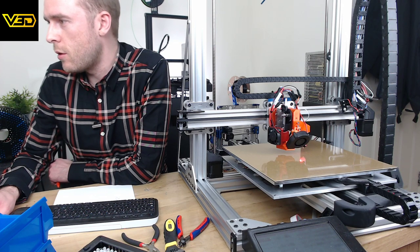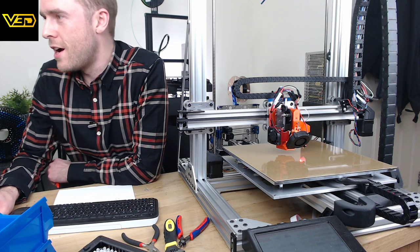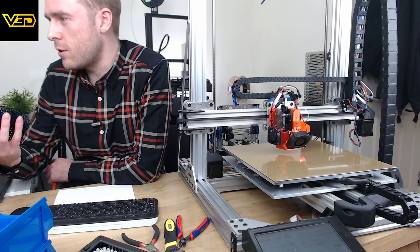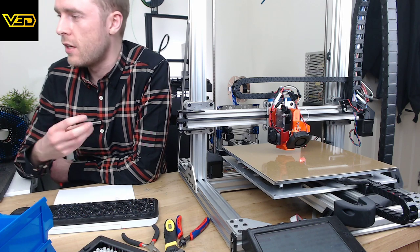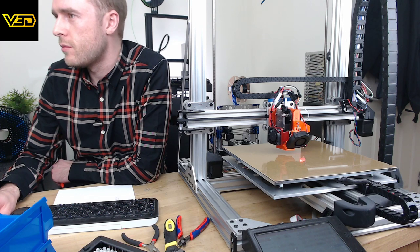You can use M301 to override those computed PID parameters, but this is not recommended because it prevents RepRap firmware from using different PID parameters depending on the heating phase. So there you go. It has a computational heater model, which means it can use different PID control methods in different parts of the heating phase. That is my understanding.